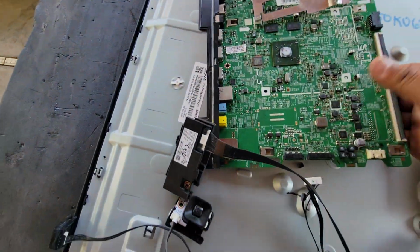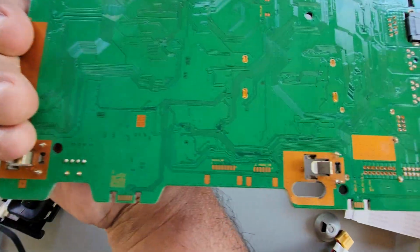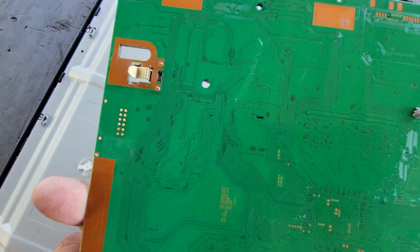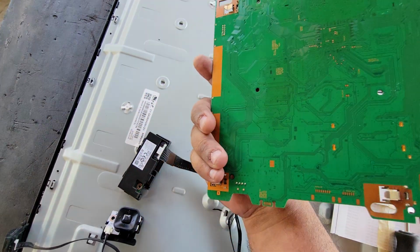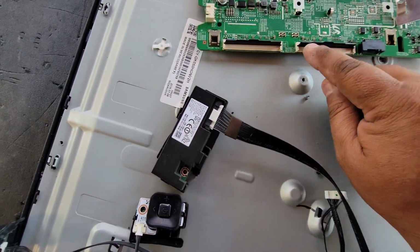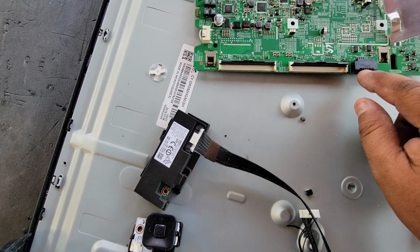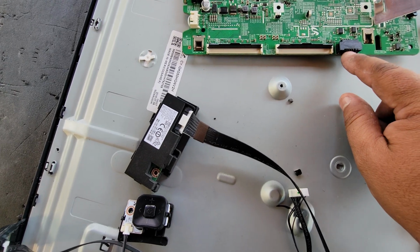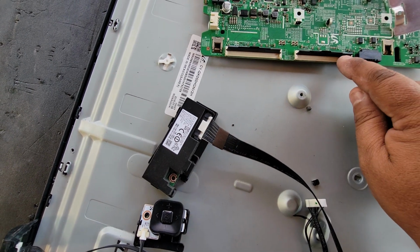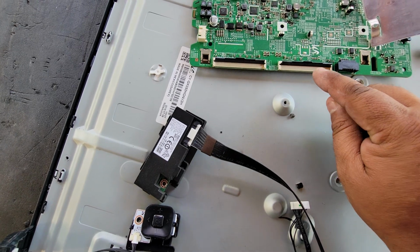Sorry about that, I had to do it with one hand because it's holding the film. So this board completely apart goes through a cleaning process and then a dip process. And that gets into everything. And the nice thing about it is even the dip process goes into all the connections, and you don't have to mask these off, by the way, through the company NanoflowX. You don't have to mask them at all. Like all the other conformal coatings, you have to mask it off and treat the board. But when you remove the masking, guess what happens?